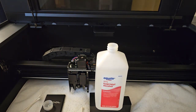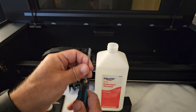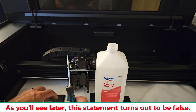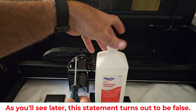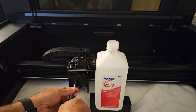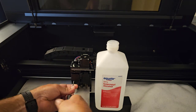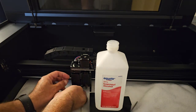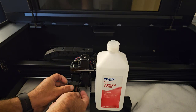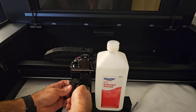Let's see how to clean the lens now. The Xtool P2 comes with this clever little tool that has a hex at one end and a Phillips screwdriver at the other — the only two tools you need to take anything off this laser. In this case, we're going to need the hex to take these two screws out. Now this whole nozzle assembly just comes right out. You'll see the air assist hose is still attached — there's a little clip holding it in, so you push down on that clip and the hose comes out.